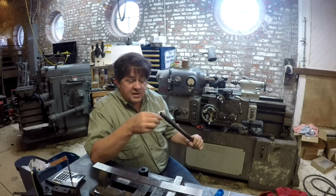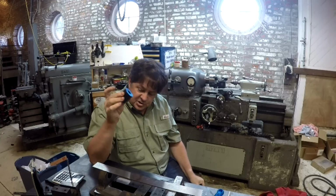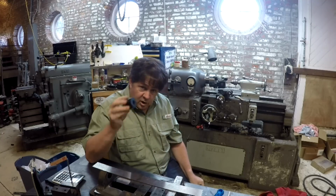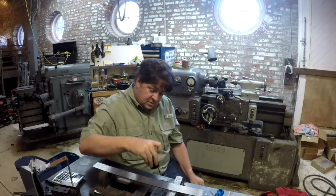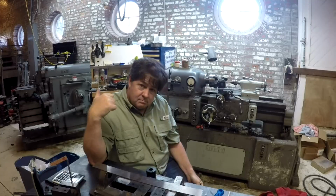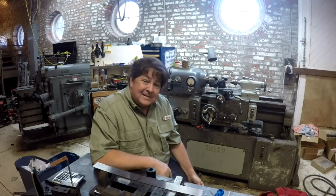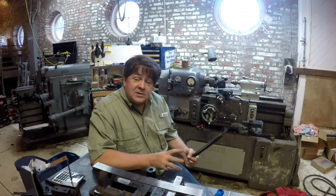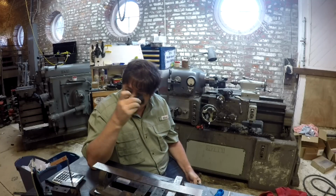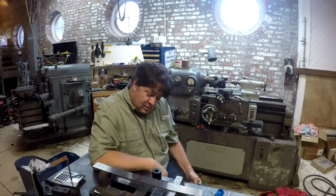We will chuck this whole thing up in the lathe once again. We will turn the OD of this to size and shape for the vise. Then we will turn it around, put it in the lathe chuck, and we will turn the screw out, which might be a fun process to watch. Foul language may ensue. Once this is all done, we'll mount the new Acetal Delrin lead screw in the vise, and we'll give her a go.